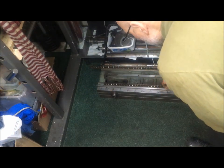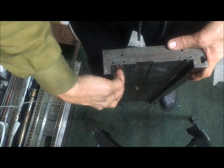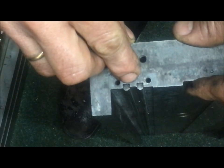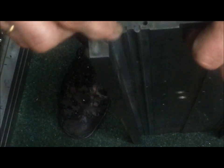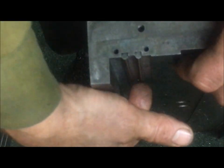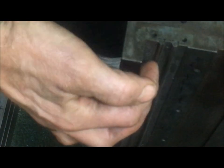These ride on strips here, and the strips — as you can see — are just round bolts, pressed in. The area in the middle there is dovetailed, and plus it's peened — they have somehow locked it by hammering or pressing down in the middle. So these are stuck there, can't get them out. But on inspection, one can see that they are worn. There's a worn ridge.